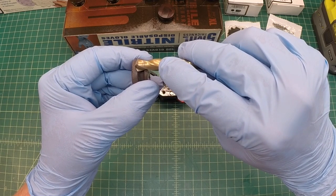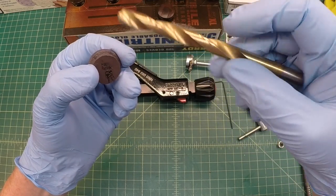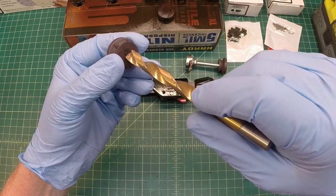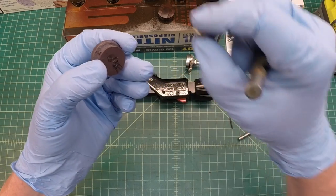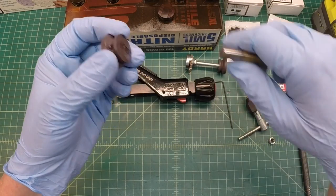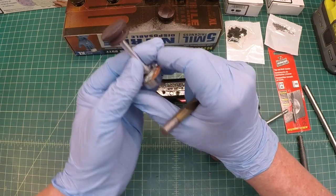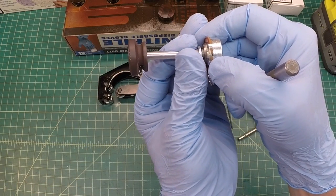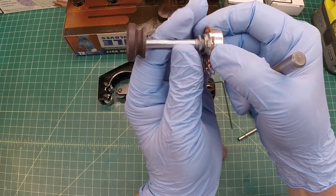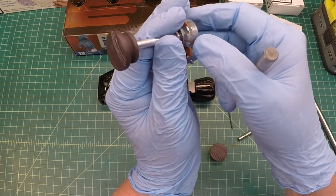Depth-wise, I came up to about right here on the knob itself. If it's not perfectly centered you've got a little bit of wiggle room — you can move this around so when you do put your insert piece in, it gives you the flexibility to kind of square things up. You can see here's one I did — this was freehand — and it rotates fairly true. It's maybe not perfect, but it's not bad by hand. A lot of the old wooden knobs are that way anyway, so you really wouldn't even see the difference once it's installed.